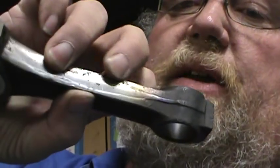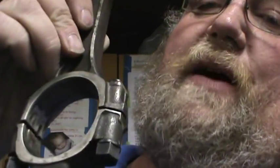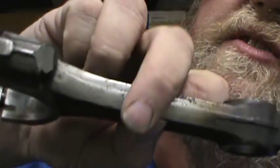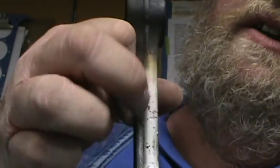Some guys' attempts at beam polish here — they didn't finish it because they were on the rod. They beam polished them, and this one's done the wrong way — the grain goes that way instead of lengthwise like it's supposed to. The sanding goes across, which is a big no-no. We'll talk about that stuff later.